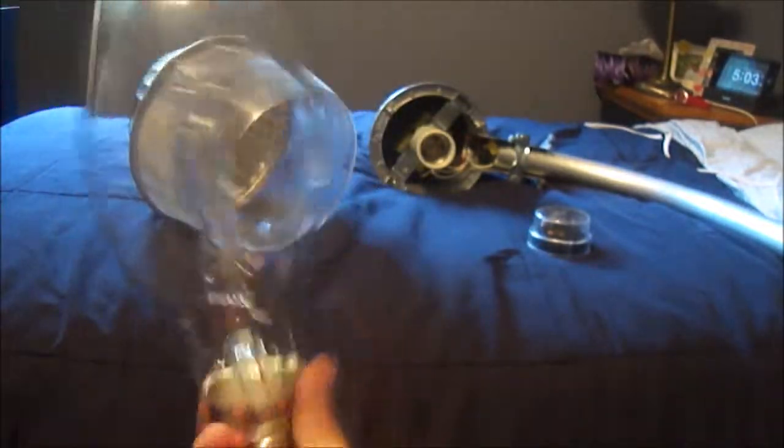Next is the light bulb. This is what a mercury vapor bulb looks like. That big thing in the middle is an arc tube, which is basically a piece of quartz that has two electrodes inside and one starting electrode. That little resistor is connected to the starting electrode and is there to strike an arc. Without it, the ballast would need an igniter, but since this is just a current limiter — a little transformer — it has this resistor so it's self-igniting. It's a pretty cool light.